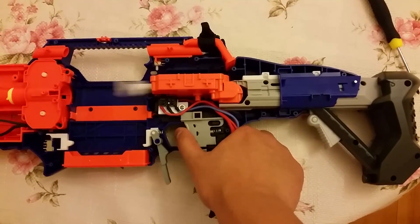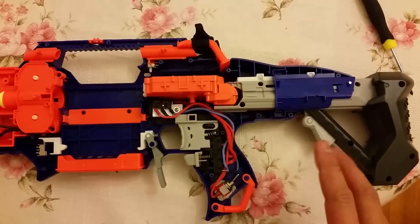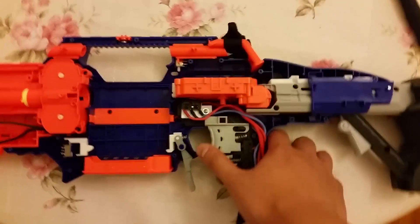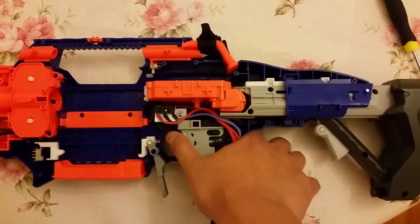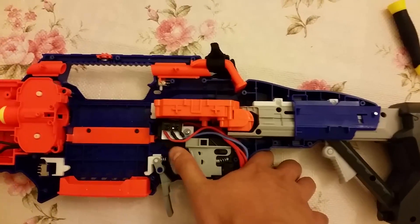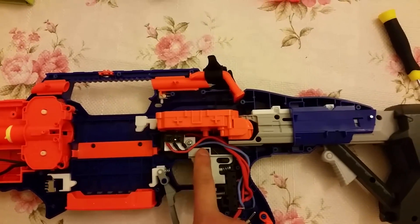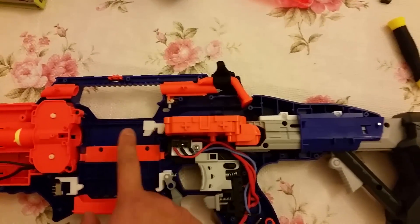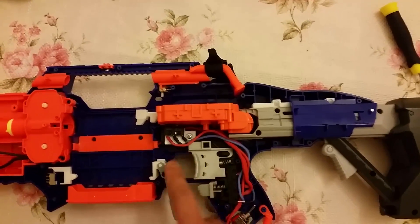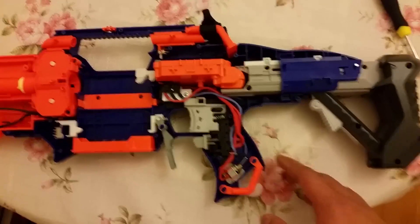This is with the new style, with the positive wire to this micro switch cut. If you look at this, you can see it still mostly cycles cleanly about 95% of the time, but once in a while the pusher will not cleanly return — there's not enough momentum to go all the way out and all the way back to break at the end of the cycle. So those are the two styles of wiring you can choose from.